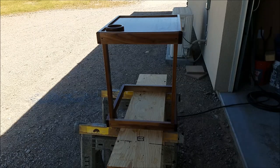What'll end up happening if you finish, let's say, a kitchen cabinet or something, and you finish the inside and you put the doors on and everything's dry and easily handled, no problem, you'll open that cabinet door the following day and you'll get hit with an acidic type of fume that'll knock you back. It'll like, wow, but because it's trapped in there and not allowed to air out is why. It's not harmful or anything. It's just really a pain in the neck.